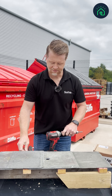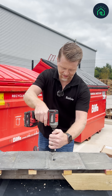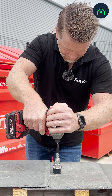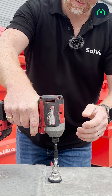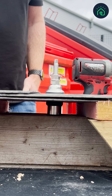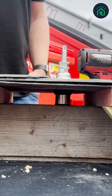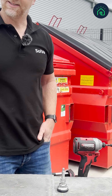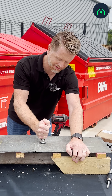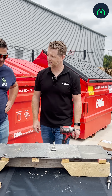I'm going to come round this side of the bench. So we've pre-drilled it with a 28mm hole saw and in we go with the seal. I can see that collar's done exactly what you said — it's expanded around the slate and taken all of that compression away. Exactly. The seal's totally isolated from the bolt. If there's any movement from snow or wind loading, you can see it moves and doesn't transfer any of that load into the slate, so they're completely protected.